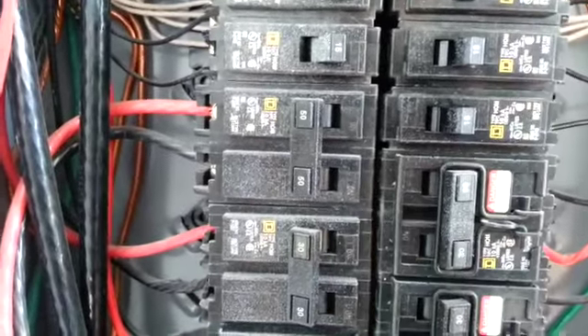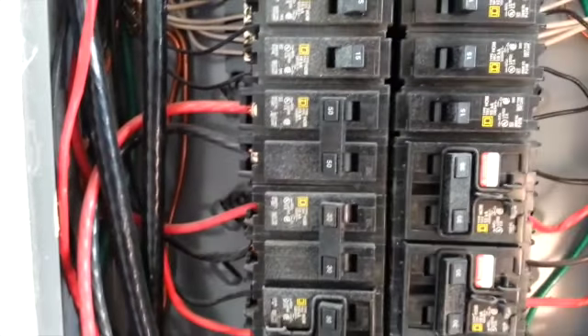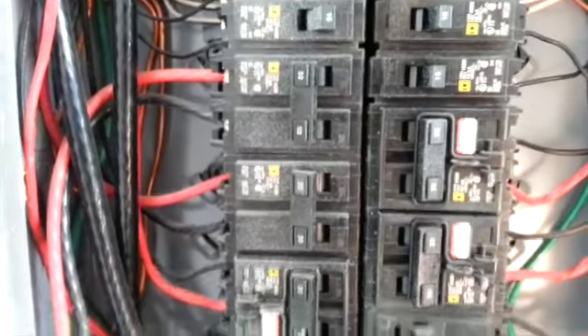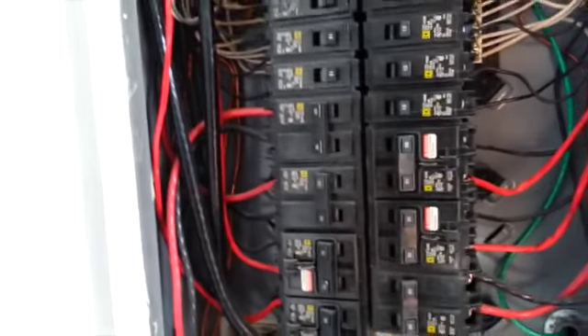You can see where I actually penetrated into the panel. This house was already wired for AC, which is on this breaker. The problem is this is a 50-amp breaker with 6-gauge wire going to it, and that will not work for us seeing as how we only need a 20-amp breaker. So I wasn't able to use this wire — I'm just going to abandon it, cut it, cap it off, take this breaker out, switch it over for a 20-amp, and run my 12-gauge wire over to it so it's no longer a fire hazard.